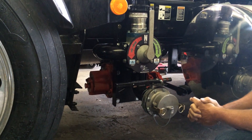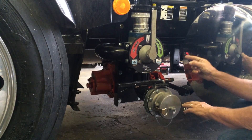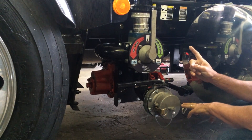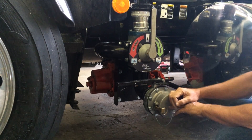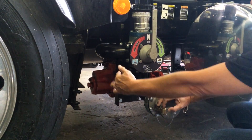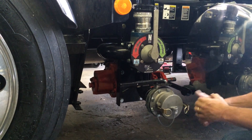The unique features of this pump system is that the pump runs in one rotation its whole life at one speed. When you set the pump up, you have to validate your rotation and validate your relief valve setting to make sure it all meets under this setup.